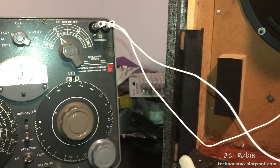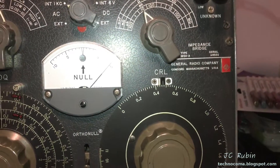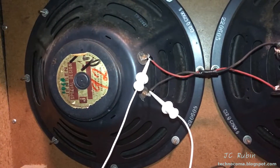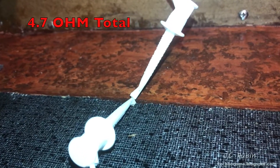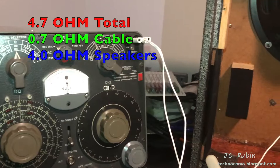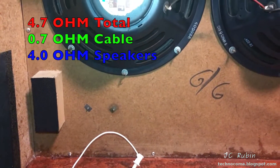A subscriber with attention to detail pointed out in my video that I made a mistake due to a problem with a cable or connection. When you get down to ohms, you can make a mistake. This test with the two speakers was returning around eight ohms, but it can't be in parallel — it is, in fact, four ohms when you take away the impedance through the cable. I've now checked very carefully and we're seeing just above four ohms with fresh solder connections. Both speakers in circuit, I've taken that value at 4.7 ohms. I want to thank the subscriber for capturing that.